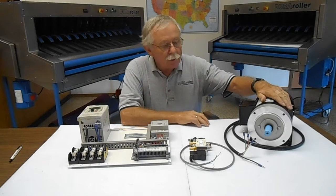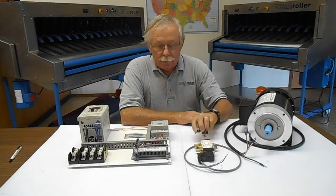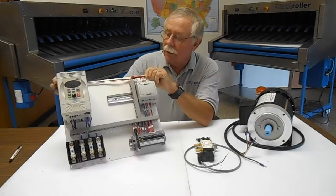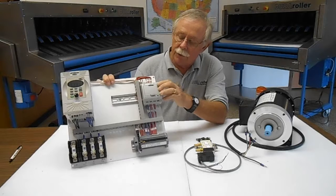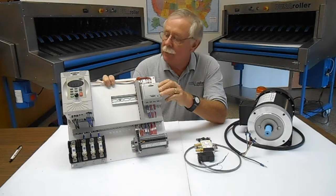The kit includes a new motor — it's a three-phase, one-horse motor. There's a new solenoid involved and some air controls. The heart of the system is the control panel. We've put together a more modern control system. We use a programmable relay instead of the ice cube type relay logic the old PDPI machines used.